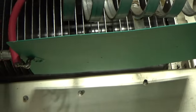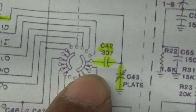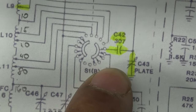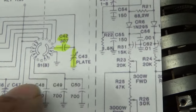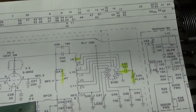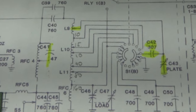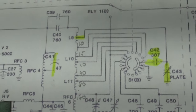What I've got highlighted here is that big flat capacitor — the big green thing, C42 — and it goes to the band switch and is switched in to ground when you're on 160 meters, adding more capacitance. As you go up the band you need more. That covers the weird stuff on the output side of this amplifier.